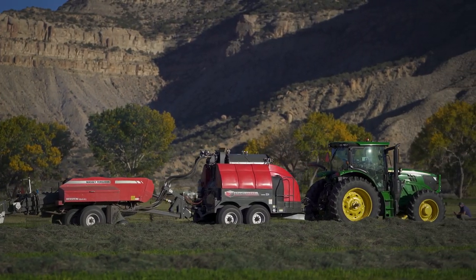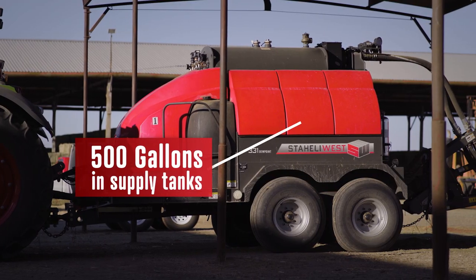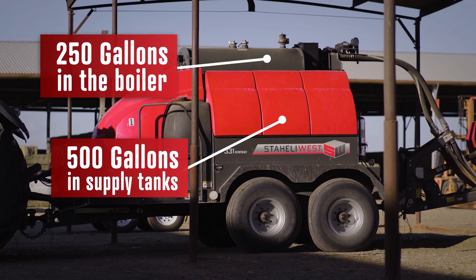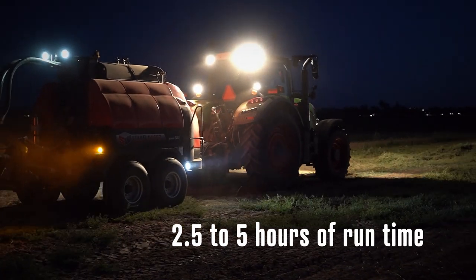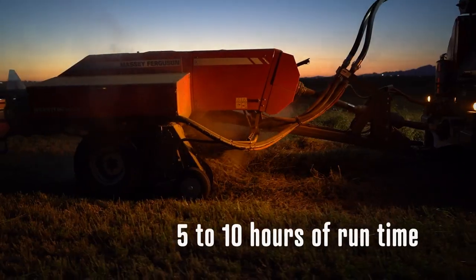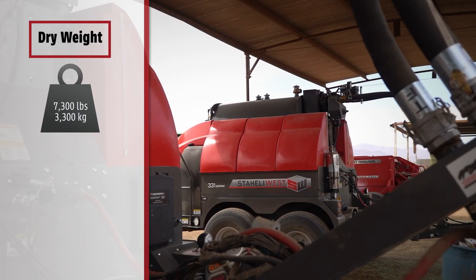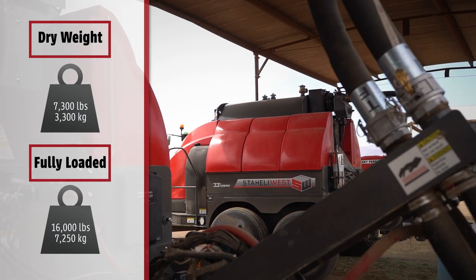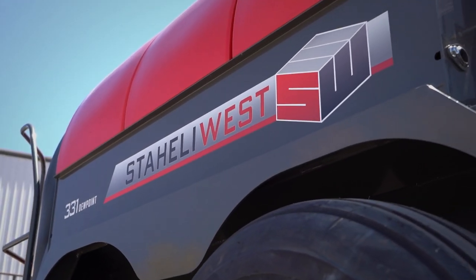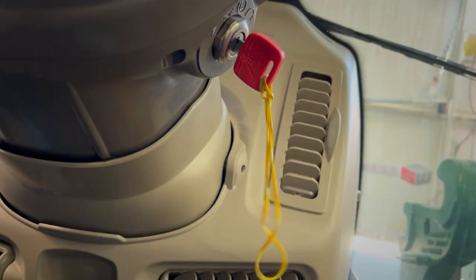It is good to become familiar with the Dewpoint 331 machine. It holds 500 gallons of water in the supply tanks and 250 in the boiler itself, giving you two and a half to five hours of run time. It holds 120 gallons of diesel, giving you between five to ten hours of runtime, and it weighs 7,000 pounds dry and 16,000 pounds fully loaded.